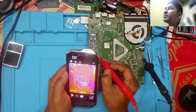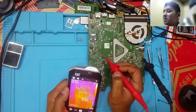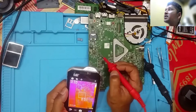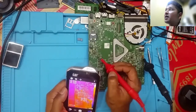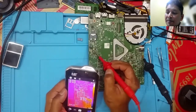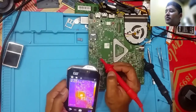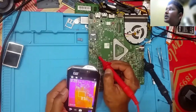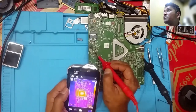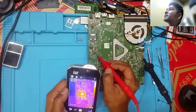Let's try it again one more time. There — that orange spot. Let it cool off again. With this thermal camera, this tool, I don't have to throw alcohol, petrol, or anything on any circuit board. I just find where the problem is or try to locate the area where the problem can be, then inject voltage there and see which part gets hot. I remove the probe — it's cooling down. When I inject the voltage, it's getting hot. There is the spot — that chip is getting hot. Cooling down when I remove it, getting hot when I inject.